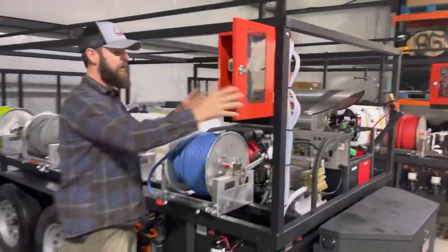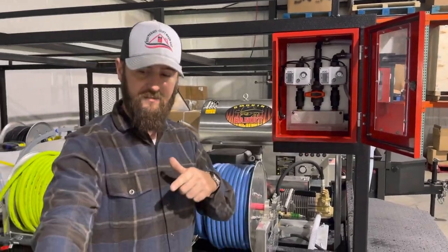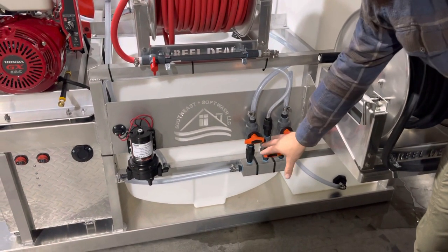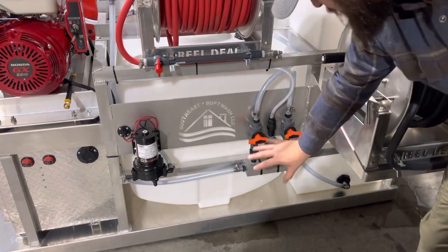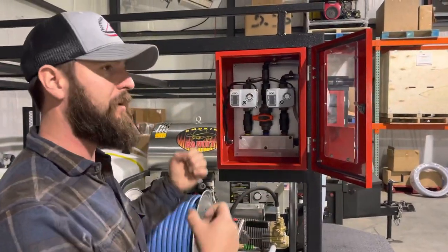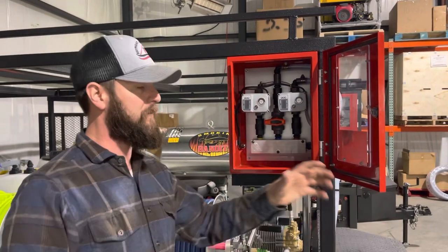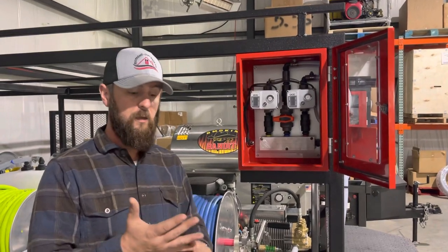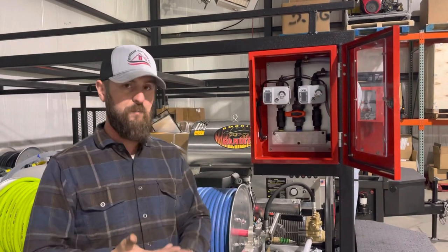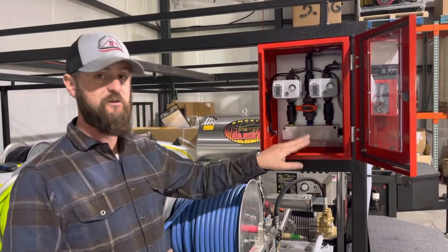The current version of the Smart Blend Pro is set up on a half-inch blend manifold. Behind us — Dusty will spin around and show you — that is what's inside the Smart Blend cabinet. This is a manual blend manifold with bleach, surfactant, and water. Here we've got that same thing with actuators, a logic board, a transformer, and your remote control — all coming together to make this remotely controllable on a half-inch system. This works beautifully with a 12-volt, even a 7-gallon-a-minute 12-volt. We use 5-gallon-a-minutes, but any of those in the 5 to 7 gallon-a-minute range — including a standard booster pump or an air diaphragm pump — will work beautifully.